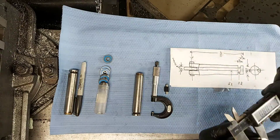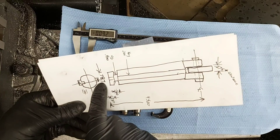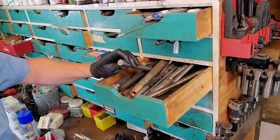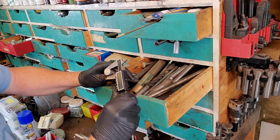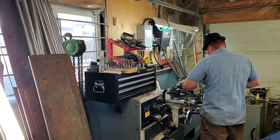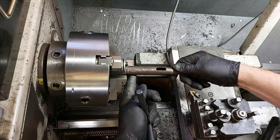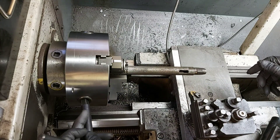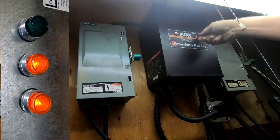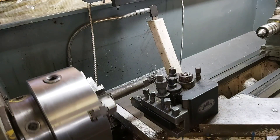It rang in at 787 thou, which is kind of odd — I'm pretty sure that's like 22 millimeters metric, but someone's going to have to fact check me on that. Being that I'm pretty cheap, I'm going to go through the junk drawer. I'm pretty sure this is 1045 steel and I think I've got another piece on the wall as well because I need three pieces and these are relatively short lengths. I still want enough material in the chuck to hold it. I know this is 1045 because I made this part probably five or ten years ago. Now let's simply park this tool off and throw a center drill in the end of it, and then we can extend it out a little bit.